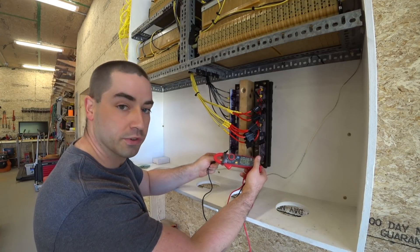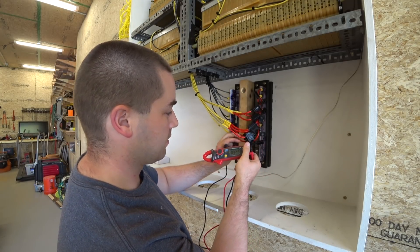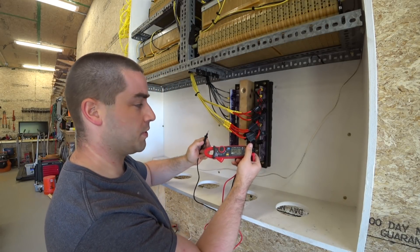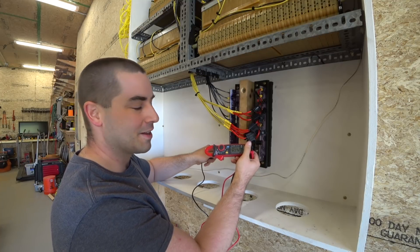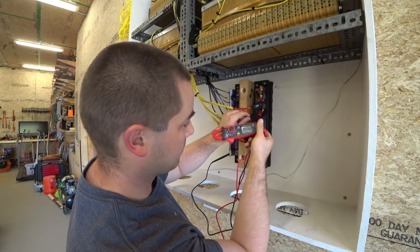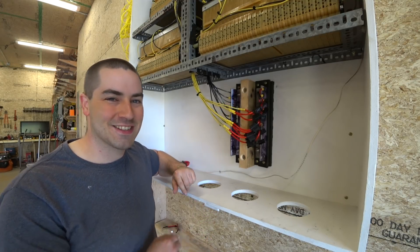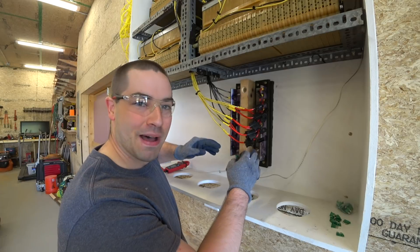Right now there's zero voltage between the two sides. Let's check right there — we've got 44.2 volts. I'm also checking to make sure there's no negative symbol on the screen, which would mean I have the polarity reversed. I already double-checked that when I put all the wires on and color-coded them yellow and black, but nothing wrong with double-checking. Given that all of these had the same voltage — 44.2 — and I didn't see any polarity issues, let's start putting fuses in. Let's put these 30 amp fuses in the fuse holders and power up these bus bars.